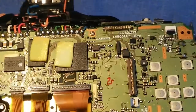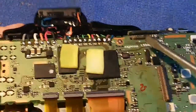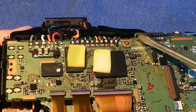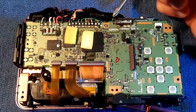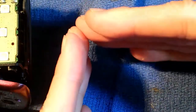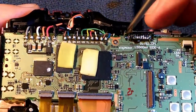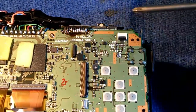Next we are going to re-solder this connector. That's going to be the most difficult part — getting all these connectors made up. We've also got to run a jumper from that ground pin to a nearby ground point. I have re-soldered these joints. This was quite difficult — the two boards are perpendicular to each other and you're bridging solder across a gap; they kept bridging side to side. I also soldered in a little jumper wire. According to my ohmmeter, I now have continuity between battery ground and the board ground.